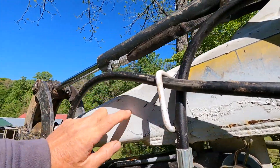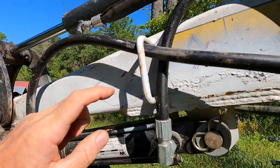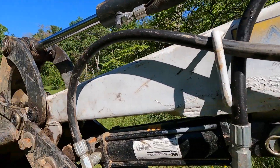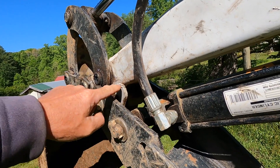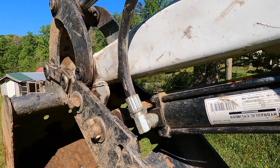Just remember that this boom is pretty light material — you have to beef it up a little bit. Over here we had two eyes for this pin, so we just welded it right straight to the boom. Any modifications to your E10 will void the warranty, so I did this after the warranty was up.